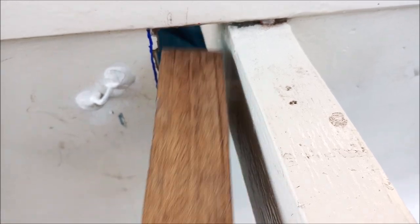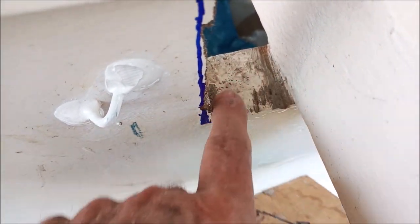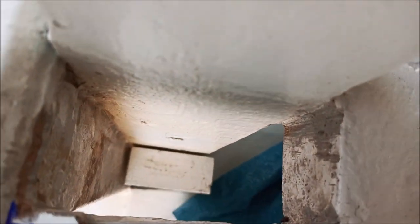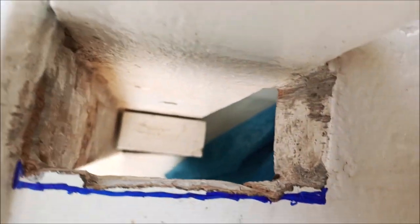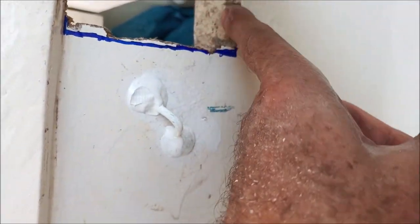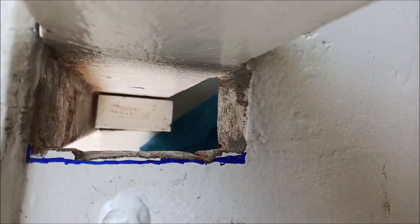I've got a little bit of wiggle room as long as I've got epoxy there — which I don't have here yet. So I've got to dremel this out and clean up this whole line, make it nice and clean. I think I've got epoxy on top there. We'll re-coat everything with epoxy on the sides — going for about an eighth to three-sixteenths of an inch thick. The bottom will be the same, and the top as long as it seals we should be good, but we may go for an eighth inch there too.